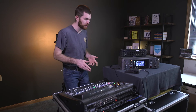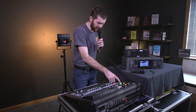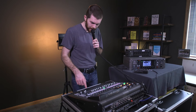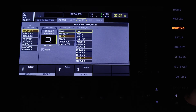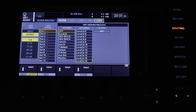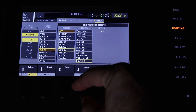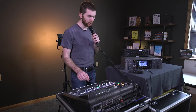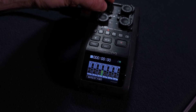Here I have an XLR cable plugged into an audio recorder and I'm going to plug it into connector output eight on the console — this is our main right output. We can hear the audio coming through. Hello? There's no audio coming through — that's weird. We have signal from our microphone, it's not muted, I can see it in my output when I turn up my fader. One last thing we need to do: go over to the user tab all the way to the right, push the first knob to switch to outputs, scroll down to number eight, select output in the category column, then select output eight as the out signal. Now we should have signal from our main output — there you go!